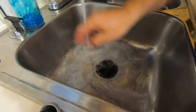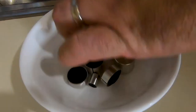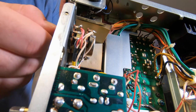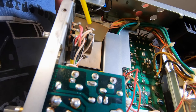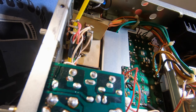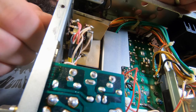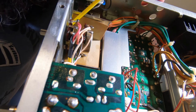The time has arrived. We've got a camera up here so you can actually see the pot — this one's the volume pot. A lot of times these get oxidized, which causes the scratchiness when you're turning your volume knob. There are a couple of access points — just get in there with the DeoxIT and hit it in the spots you can reach. Then work that knob back and forth. It's almost instantaneous improvement — you can literally feel it working through the potentiometer.